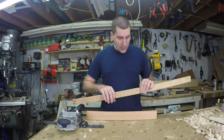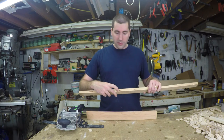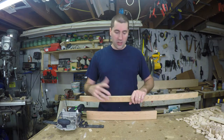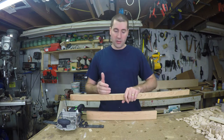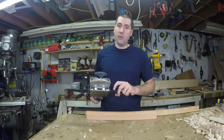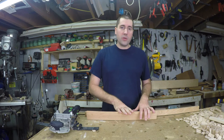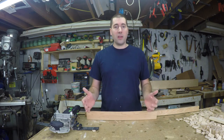The second problem is that on some mortises there are little burrs left on the end when you cut the domino. This happens even with a very sharp blade — usually it's not a big deal, you can sand it off, and I've never had a problem gluing up without addressing it. However, that little burr is enough to mess up the registration of these pins. If one board has a bunch of those little burrs and the other doesn't, they end up not lining up after a while.